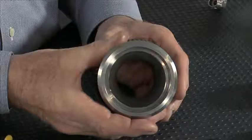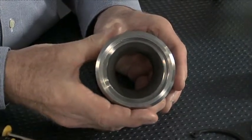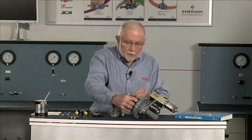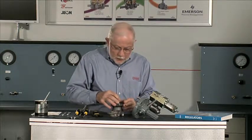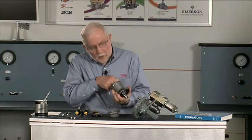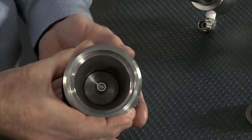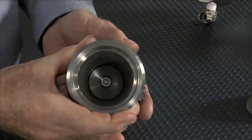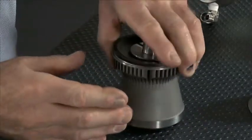This is a unique cage — if you look down in here, you can see it's tapering in. We actually take some pressure drop in there before it gets up to the valve plug. If we pull this plug assembly out of the bonnet and look up the cage, we can see all we see is that metal plug up there — we don't see any rubber part. So it takes the energy out of the particles when it hits that hardened stainless steel plug instead of the elastomer.